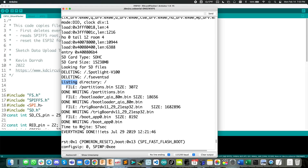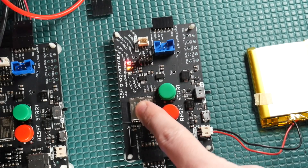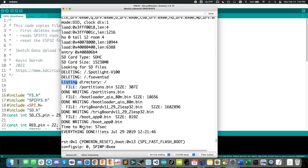What's really cool about this project is that these four files are pre-flashed into the ESP32, so it's copying them over from the internal flash on the ESP32 to the micro SD card. At the end of this video I'll talk about ways we can improve on this and maybe some other cool features we could add, but for now it's doing just that — straight from SPIFFS flash memory to the micro SD card.